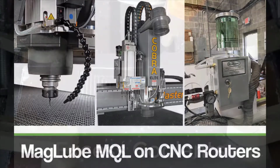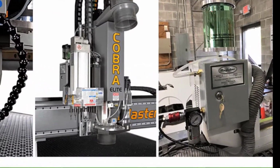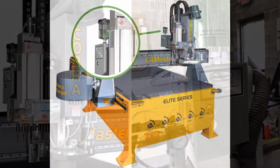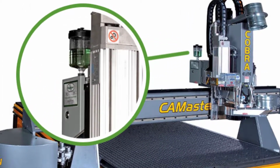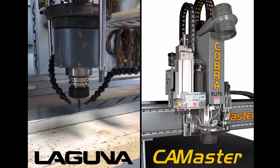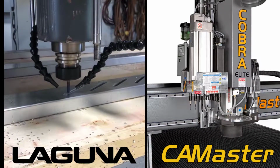The second method, which is more cost-effective and produces higher quality results, is known as micro-lubrication, or minimum quantity lubrication. Premium quality CNC router manufacturers are integrating MagLube's MQL systems into their machine builds. CAMaster and Laguna Tools both use MagLube's 21st century micro-lubrication as their preferred lubrication system.